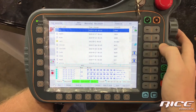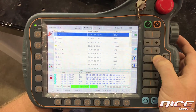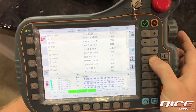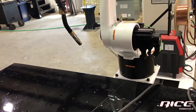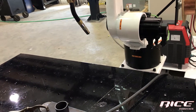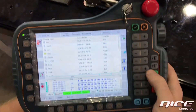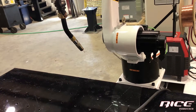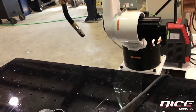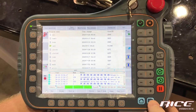Moving down this side, we've got our gas test — hit that and you hear the gas. We have the wire feed, which is wire plus and wire minus. You can turn the camera on the torch and actually see the wire going in and out. There are two separate keys for that. One is the continuous feed, and this one is the inching feed — you hit it one time and it just inches out a little bit at a time.